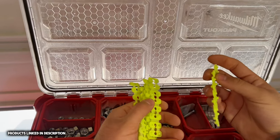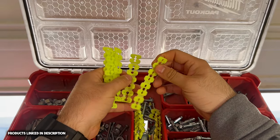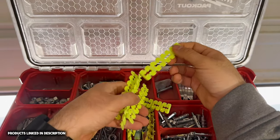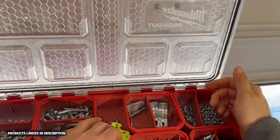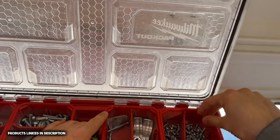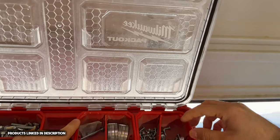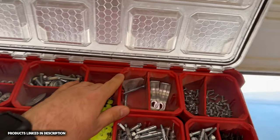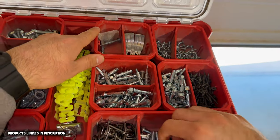These are called caterpillars — they're for receptacles when they're recessed in too much and you're trying to get them flush to the drywall. Sleeve anchors I use all the time to mount onto brick and concrete. I forgot what these are called exactly, but we use these in new construction. I don't use them too much since I was in service, but definitely need some staples.